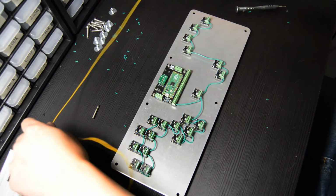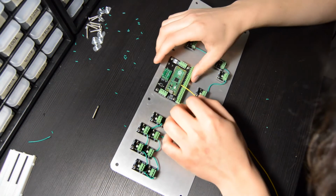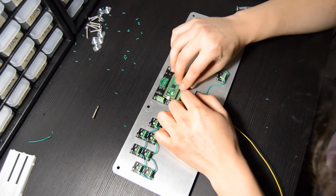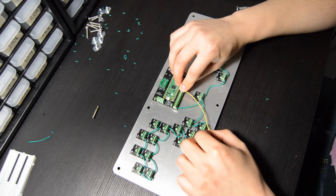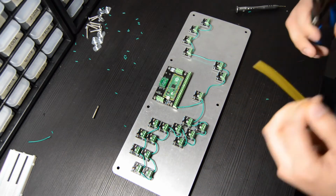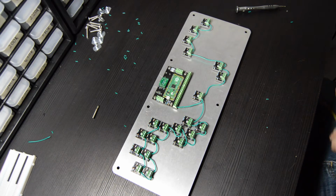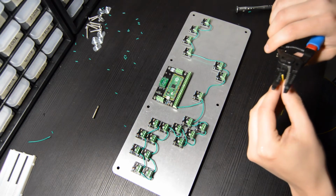All right, now we can get into the last bit of wiring, and what we're doing here is connecting the center pin of each of the MX1S boards to the corresponding terminal on the DIDY board itself. You do want to stick to the default layout when you're doing this. If you want to do any kind of remapping, that can be done later through the firmware, but it's going to make your life much easier to just stick to the default layout.